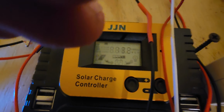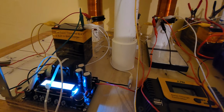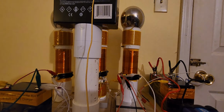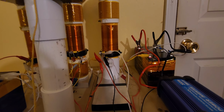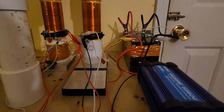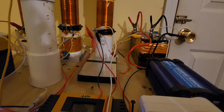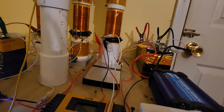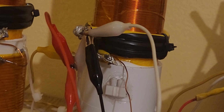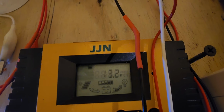Still, I'll shut the inverter off. It will recharge itself very quickly. The beauty of supercaps. So, what's occurring here is the supercaps run the transmitter. The receiver coils are a separate system. Depending on how you ground it is where you get the extra power. You ground it through a capacitor, which is a blocking device to avoid detuning, and it also gives you circuit isolation. And then you combine the outputs of multiple receivers in parallel through a bridge rectifier, right there. Your bridge rectifier goes on your L1 coil, and you might have to tune it with a special capacitor. And you can figure that out with an LCR meter and an online calculator.